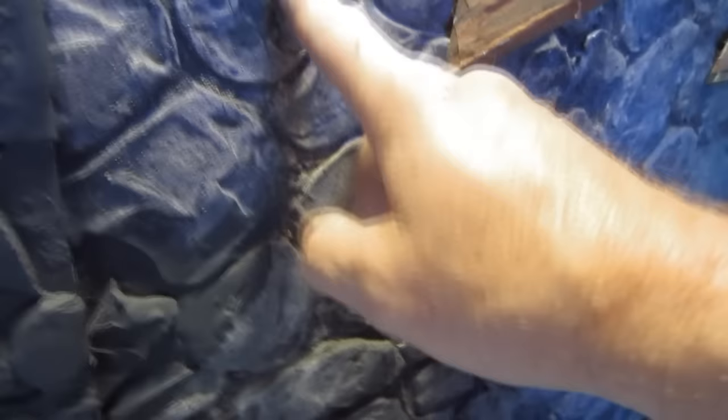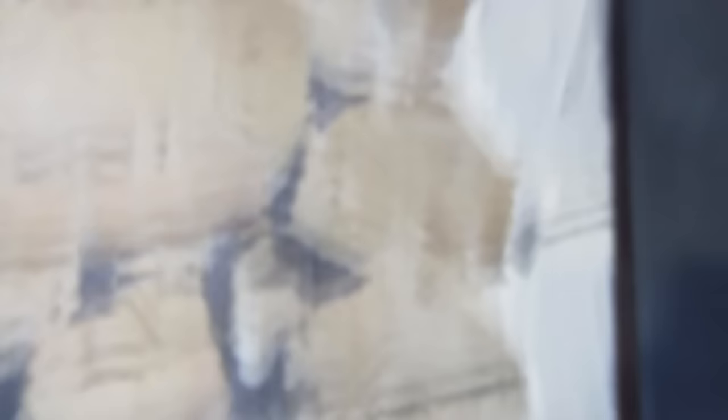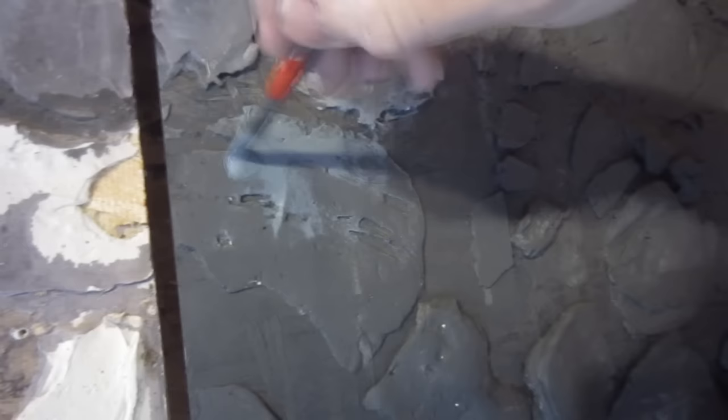All that's dried out. You can see that's the rock that's painted well, and I've got to get the new stuff looking like that. I think the original paint was just white and black — it's pretty much gray, even though it looks a little blue. I think that's just how the paint took on qualities from being applied to the drywall mud. I mixed a little black and white to make gray, tested it, it was a little too blue, so I added a significant amount of red — two pretty good squirts — and got it real close.